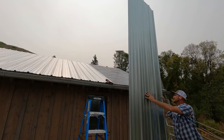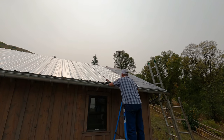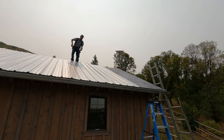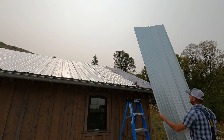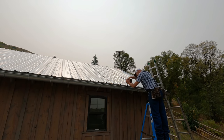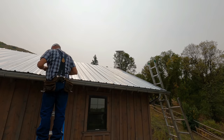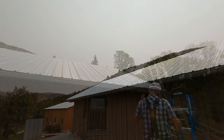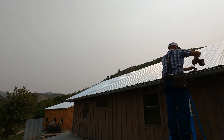Back to the roof. If this is not the correct way to install a metal roof, specifically to our application, then I'm not sure what that right way would be. The things that seem to be important to me come down to lining up the tin properly on the roof, minimizing the number of penetrations, yet installing enough screws to ensure that the roof stays where it's put, placing the factory cut edges at the bottom, and the edges that I cut will be hidden under the ridge cap.